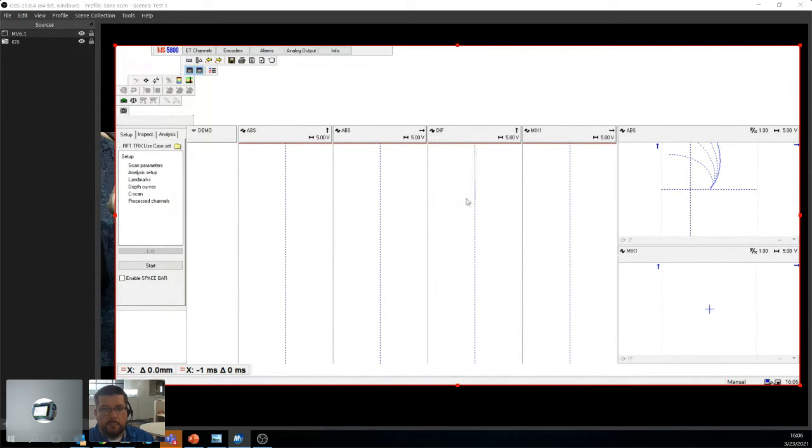So I'm going to select the material out of my list. I'm pretty sure it's 316. My thickness, I'm just going to take a quick look. It's about 160 some, so let's go here. 165, it's gauge 16. Now, as you see, my resistivity has changed, my thickness changed, and my F90 changed. If I bring this to this, my F90 changed as well. It's basically just doing 3 times the resistivity divided by the thickness squared. So that's how we're calculating the F90.